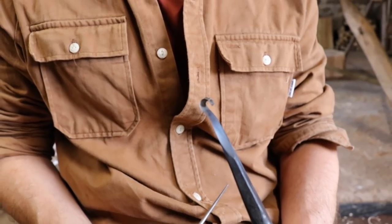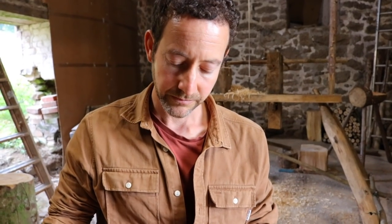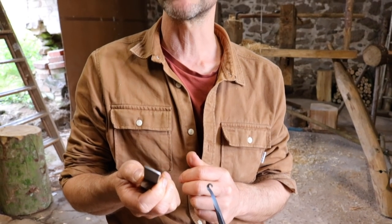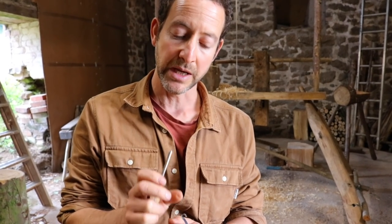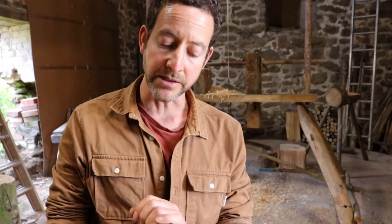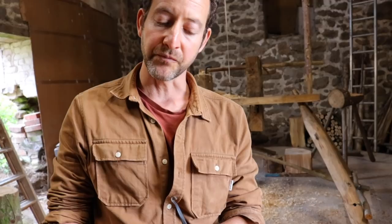If people don't have these particular tools, they can use wet and dry paper wrapped around a little bit of board and just polish the back in the same way. You can use 600 grit or 1200 grit wet and dry depending on how blunt the tool is — 1200 is usually fine just to bring the edge back, or if it's getting a little blunt do some work with 600 and then go to 1200. I never feel the need to strop these hook tools with abrasive paste and leather — they take a lot of abuse from big lumps of wood spinning on the lathe, so I've never felt the need to polish them to a razor-sharp edge.